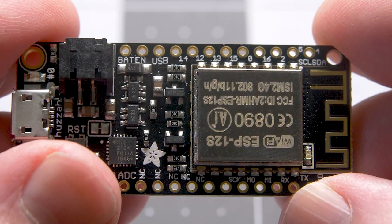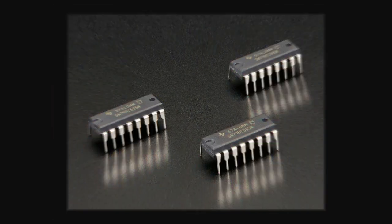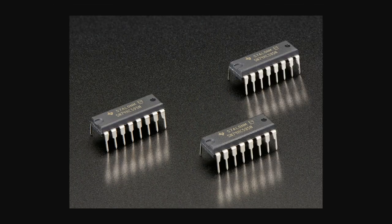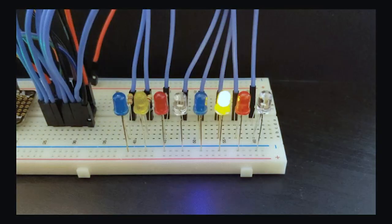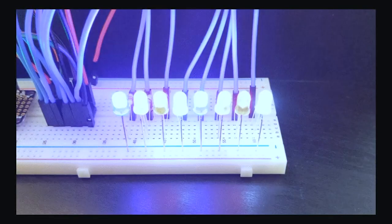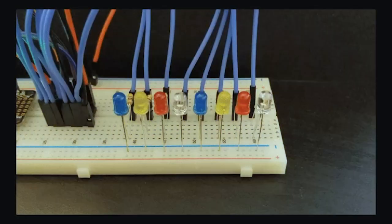One of the most vexing things about designing with microcontrollers is running out of GPIO pins, and one of the earliest workarounds is using a shift register. You wire them up to your board using a few GPIO pins, similar to a serial SPI protocol. With just one shift register you get eight additional GPIO pins, but they're chainable, so with three you can drive up to 24 pins. While the tool is old, Catnip and Boar has a brand new guide up on how to use them. Go check it out!